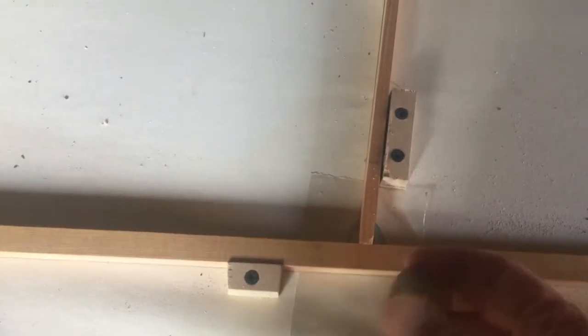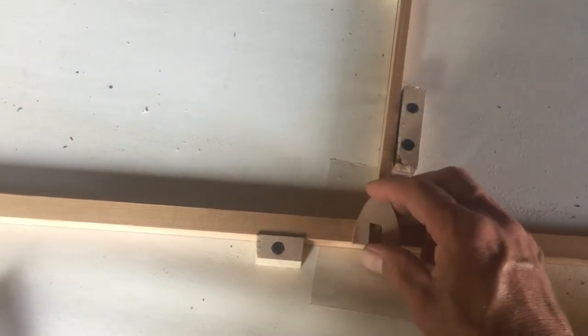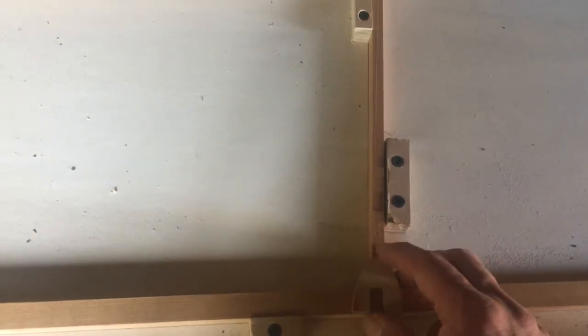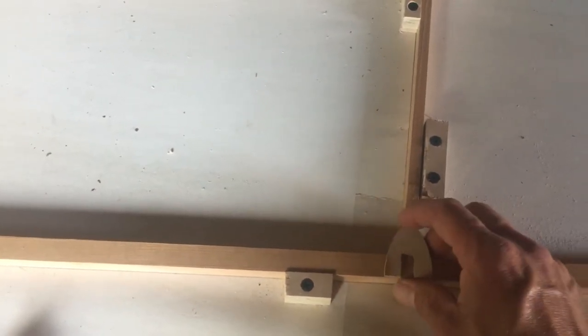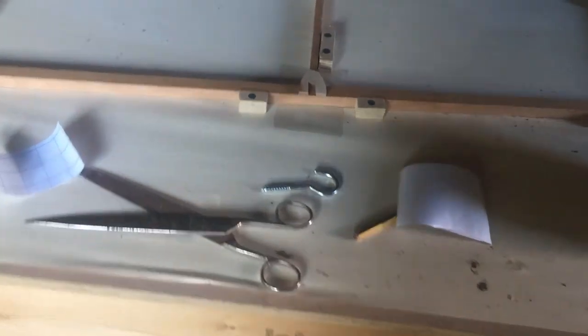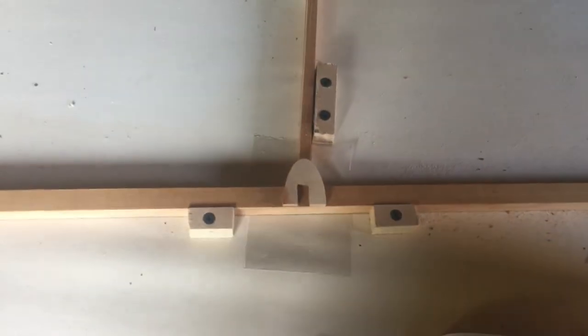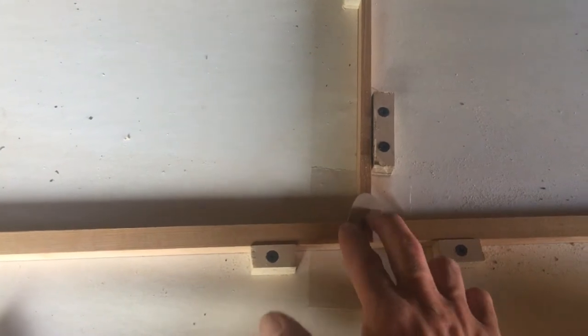Then mix in the filler and drop these on in the right places — all of these along here, wherever they are required. And then I'm going to use some weight. The epoxy doesn't really like to be squished too hard. The idea isn't to clamp it as hard as you can, because you'll squeeze all the glue out of the joint. So I'm actually going to use some 2x4 material and put some weight on top to apply even pressure on all of these joints.